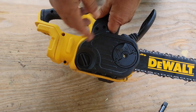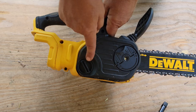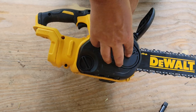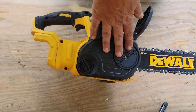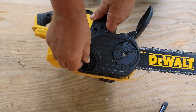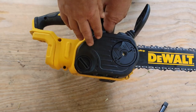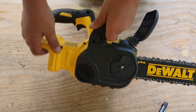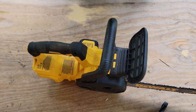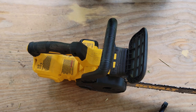What I'm doing today is taking this chain off to get it sharpened and put back on with an electric sharpener. This is your chain tensioner and this is also the lock-down for the cover — it secures it so it doesn't slide and accidentally turn. This is how you take the cover off. Let me get my gloves on — this chain, although it needs sharpening, is probably still sharp and I don't want to cut my hands.